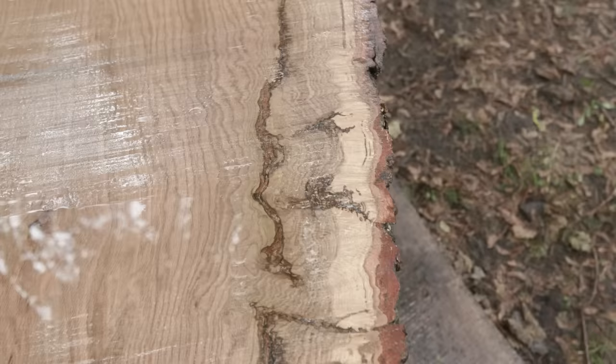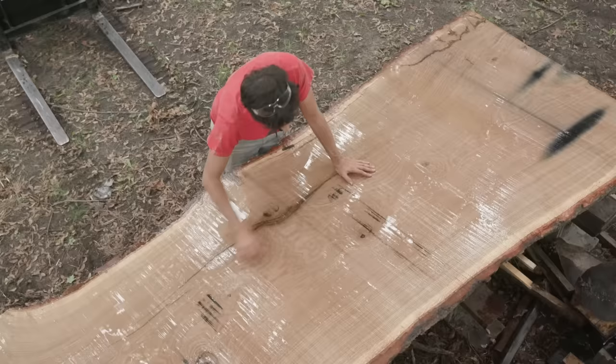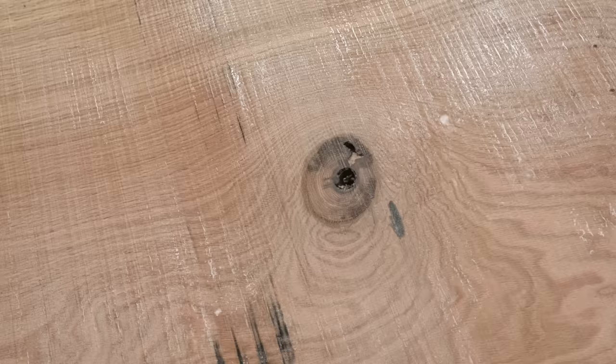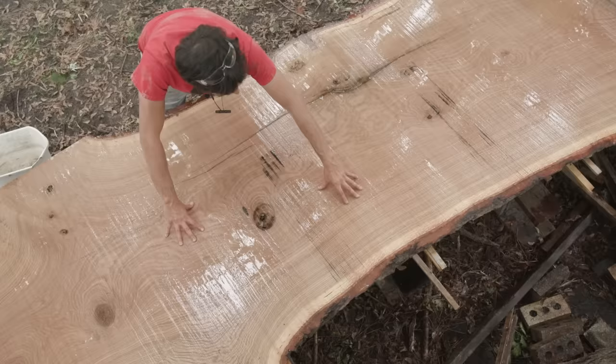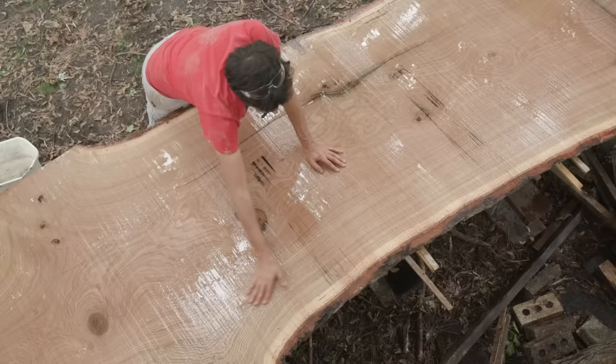What's interesting about white oak is it stains really easily when it comes in contact with iron. So you can see staining here already from my pallet forks. That's just on the surface, but white oak will stain super quickly. So don't leave it sit on something with iron in it, because it will stain even deeper than that. So you can see we're starting to get into some more tighter grain material. We have a little bit of the flat sawn area here with the cathedrals in the middle still. But as we get out towards the center of the tree, we're gonna see the growth rings start to come more vertical towards the surface, and eventually it'll be to the quarter sawn orientation, which was happening out here. We're starting to see a little bit of ray fleck towards the very outside of the slab.